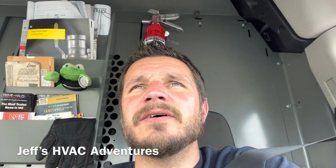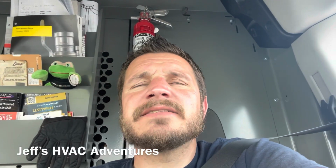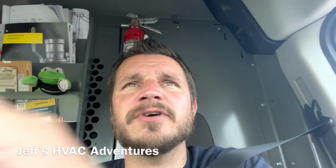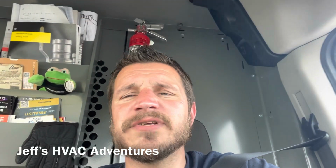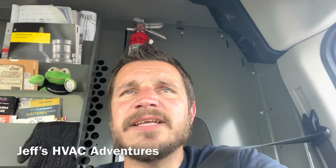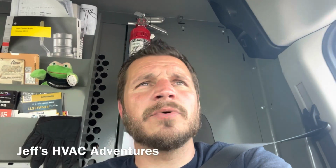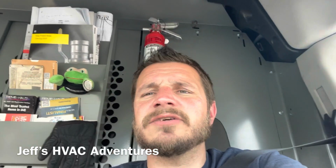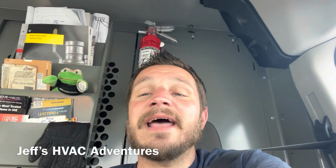Give it a minute. All right, guys, hooking up that unit with a traditional thermostat did not work, and it didn't work because you have to go in and tell the unit that it's running with a traditional thermostat and not a communicating thermostat. And the way you do that is with WaterFurnace's AID tool, and I don't have this AID tool, and apparently you cannot even diagnose this unit without the AID tool. I had to call tech support, and after telling him how ridiculous it was, he told me that it's going to cost you $190 to get this tool to even work on this piece of equipment. So I'm going to have to order that tool and go back.